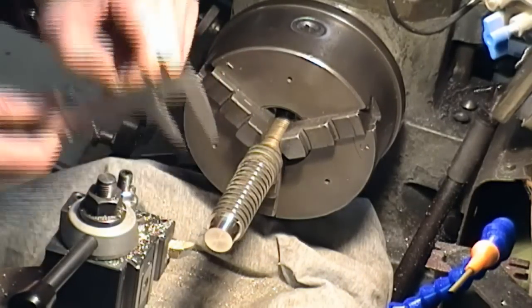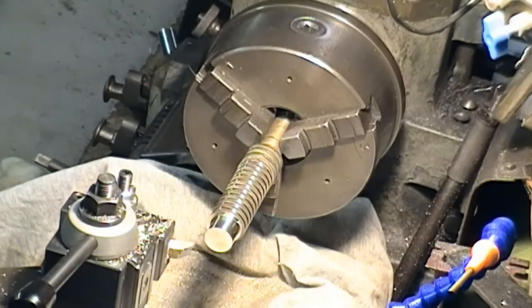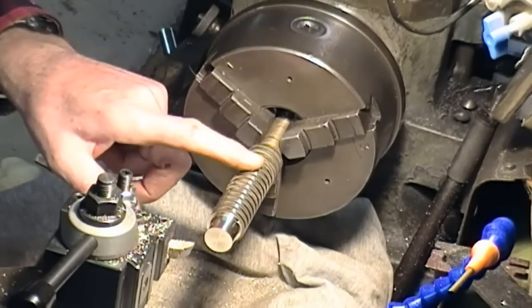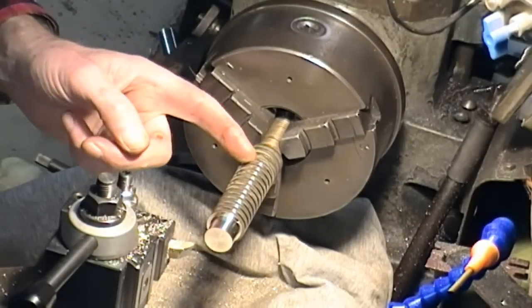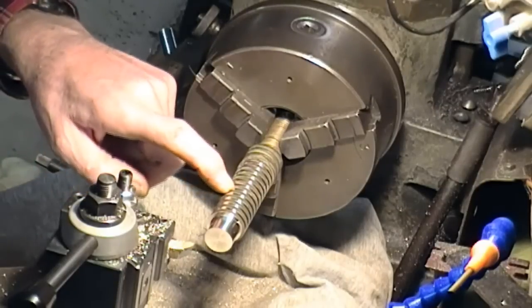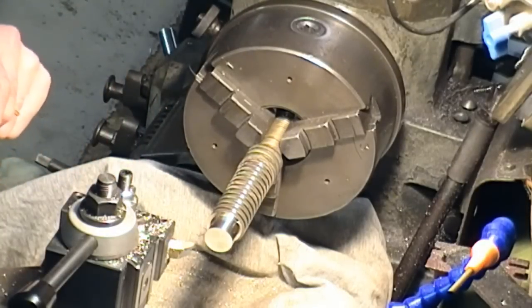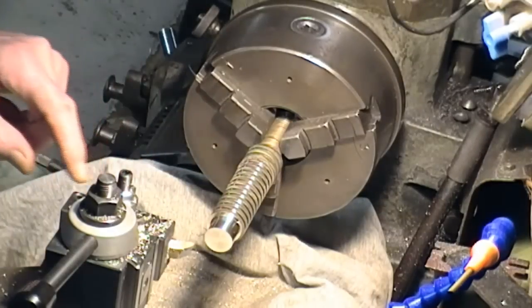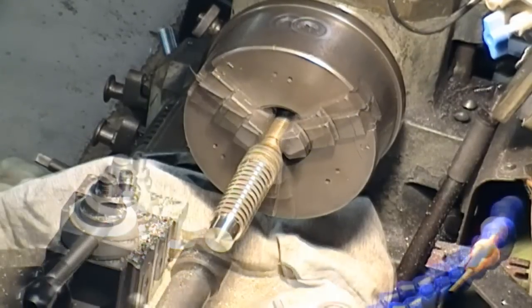I'm just taking the threads off here to get the core material, and it's just over three-quarter - about 800 actually, but I'll only get about three-quarter or three-quarter plus out of that. We'll chamfer off the ends - cut it, face it, chamfer it, then drill in the middle and tap it and put a steel handle on it. I'm rather keen to get yet another hammer; I've got copper and I like the idea of a brass hammer.